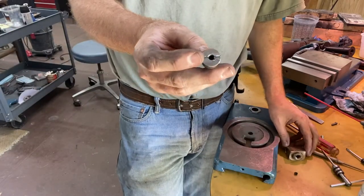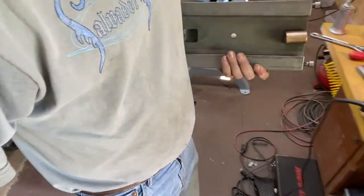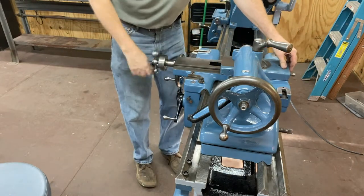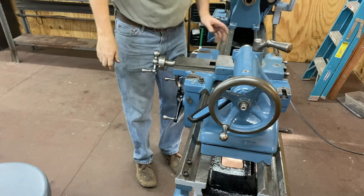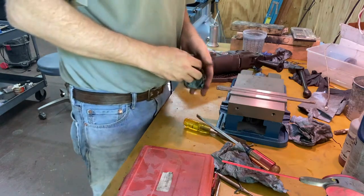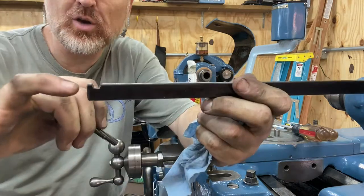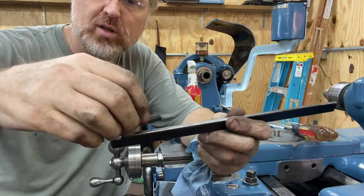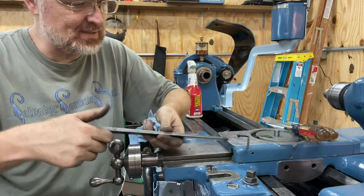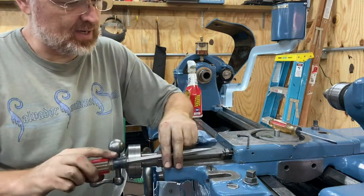This had been cammed out quite a bit and I cleaned that up. This will go on the cross slide and then we'll put the gib in. That seems to be going fine. There's my gib — I'm going to clean that up a little bit and put some flaking on for oil retention. There's a notch right there — this bolt will go in there, and that will pull it in and out. It slides in there like this with the bolt in first, then I'll tighten that up.